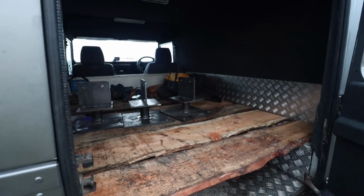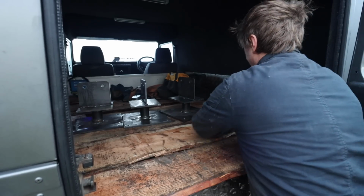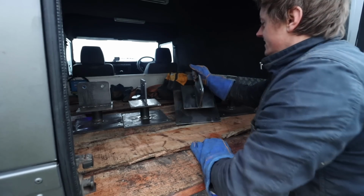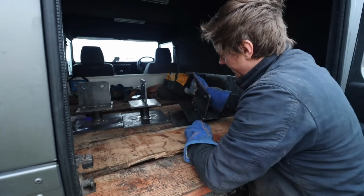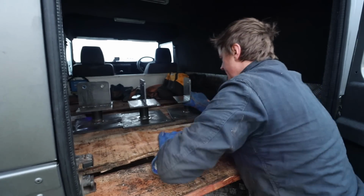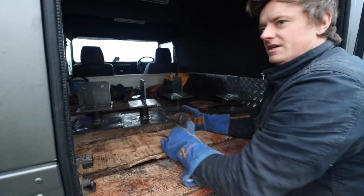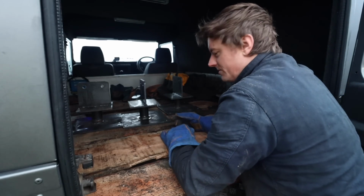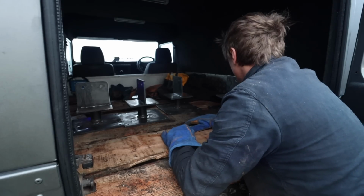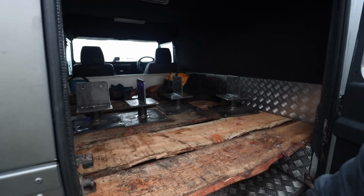galvanised. Right, it's the next day, morning. I'm just getting loaded up. One thing I forgot to do, and I'm doing now, is I didn't have the holes drilled for the galvanising on the top. I did it on the model, but then I forgot to actually transfer that drawing onto the computer, and I printed out the old drawing, so I'm just manually drilling out the top drain holes for the galvanizing. Yeah, we'll get these loaded, we'll get off to the galvanizers.